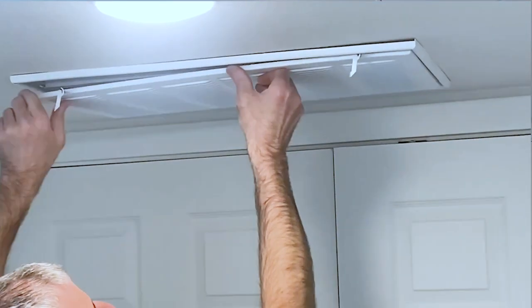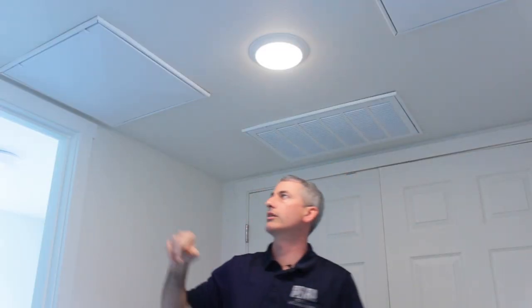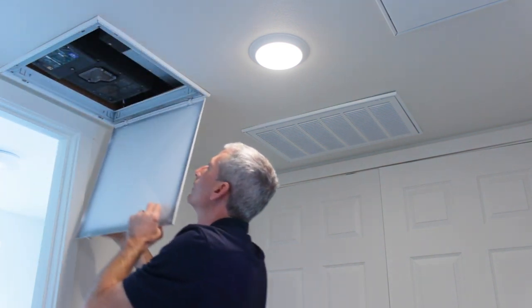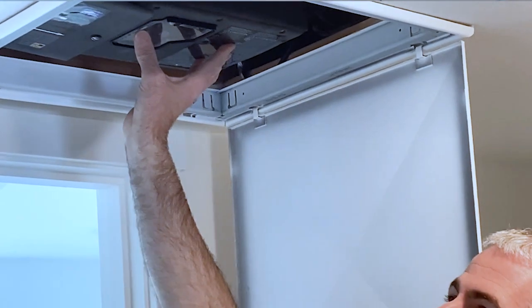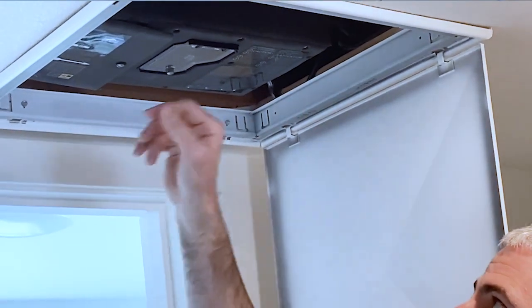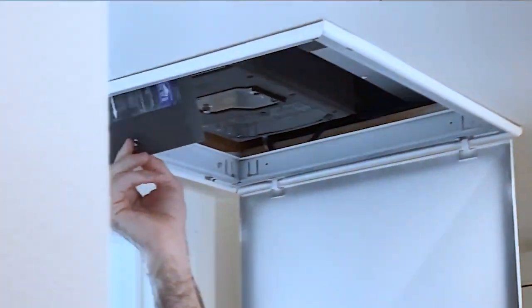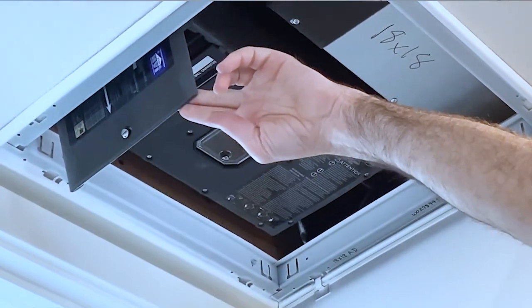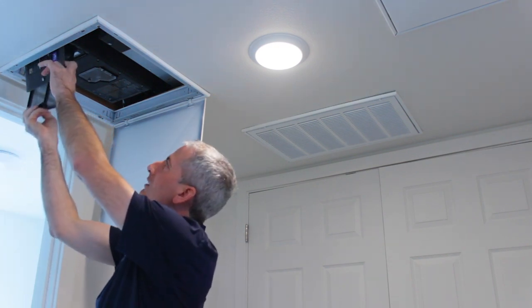We also have our fresh air fan, which is bringing fresh outside air into the space. It's going to be a separate device behind the white panel. This is our Panasonic fresh air fan that's bringing outside air into the ducted system. It has its own filter, so you'll have a little twisty knob there. And inside of here you have another washable filter. So you're going to want to do that one. Again, you're going to check that every 1 to 3 months. Wash or vacuum as needed.